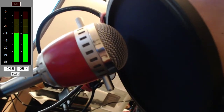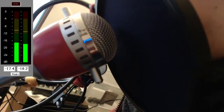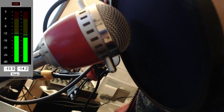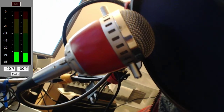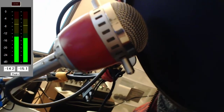And this is a very important thing: the sound that's going to come into your whole setup is going to start with the microphone. Well, it's the entry point for your sound. If you're going to use an XLR microphone, that probably means it's going to be a powered microphone. That means that your mixer panel or whatever you're plugging it into is going to have to support phantom power or something of that sort. If you don't know what phantom power is, you're probably going to have to ask at the store when you buy it. But in any case, this one is a phantom powered microphone.